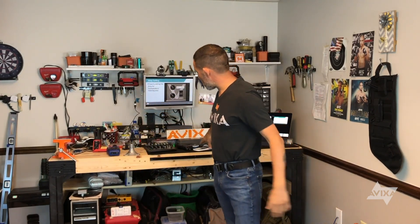I insert my 0 dBU signal into the amplifier, and then I should have pretty close to what I am requiring for that listening level — 25 to 30 dB above ambient at listening level. So that's part of our whole balancing of our audio system, making sure our audio system is functioning as it's supposed to be, using math to get our audio system to where it should be, and making sure that we can do that sustainably, repeatably, quantifiably through the maths, through calculations, using my calculator.